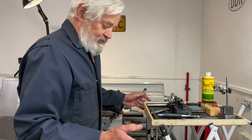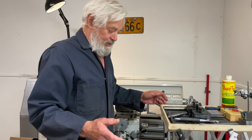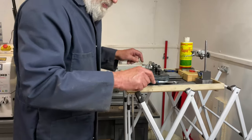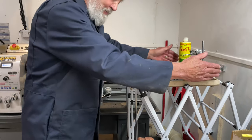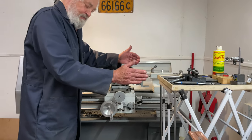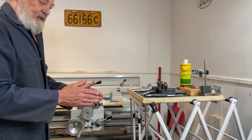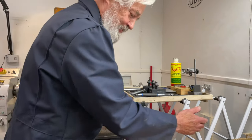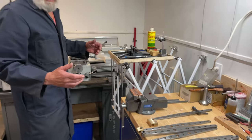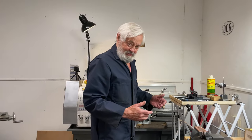So what I want to do for the television screen or computer monitor support — I want to take the two scissor sets with no cross members, so they can go independently in and out. So I can bring them out in unison, or I can pivot them so I can bring the screen sideways and turn it this way or that way. And it's a fairly light mechanism. The current supports on the market are quite heavy, and I think the weight could be as low as half of what is available today.